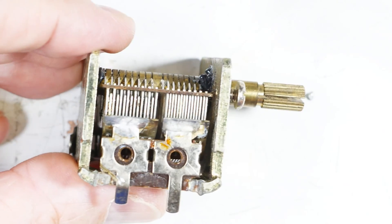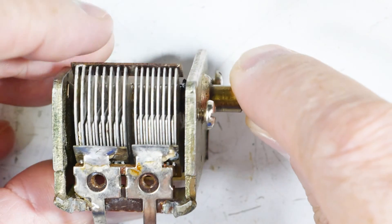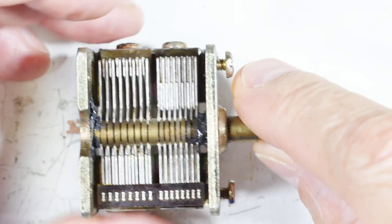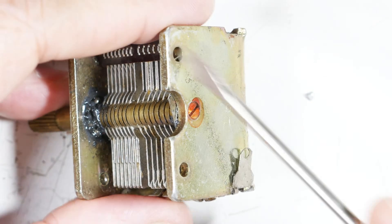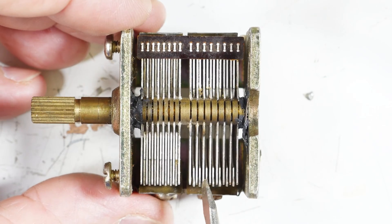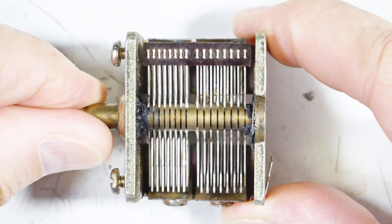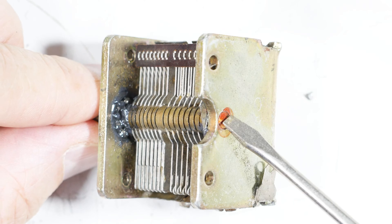There will also be mounting holes - you can see I've got screws in there, three holes typically threaded on the front. The danger here is there's very little clearance between the plate and the static plates of the capacitor. If you get screws that are too long and drive them in there and they strike a plate, you start bending things and the capacitor is pretty much gone. On the back side there are holes for a spring, which holds tension on the shaft. That's important because if the shaft moves even a tiny bit, the plates will drag and the capacitor shorts.